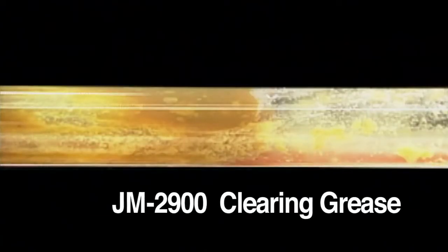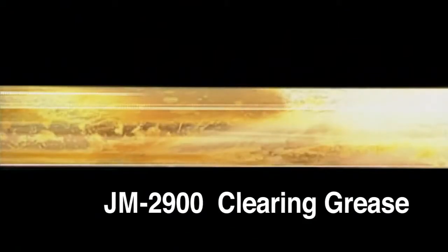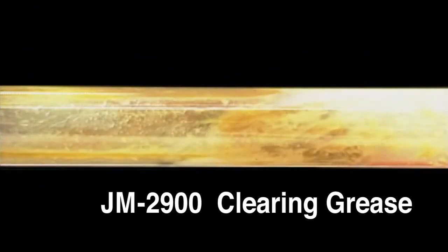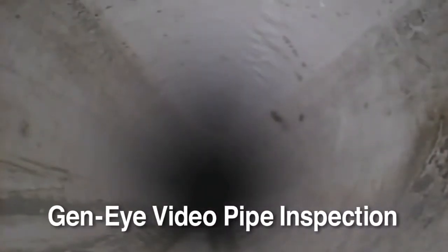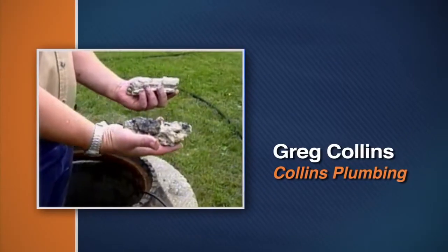Water jets use a stream of high pressure water that hits the stoppage and flushes it away. The thrust of the jet nozzle drives the hose down the line and gives you wall to wall cleaning action. We have a camera that also goes down through the drains and when you're finished with the General Jet, the drains are as good as new — you can actually read the writing on the inside of the piping. What we usually do is get a bucket, a couple gallon pail, and just keep the grease for our customers to show them, just so they know what it's doing.